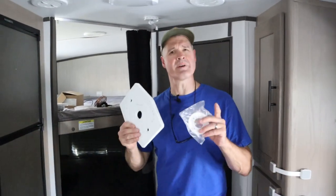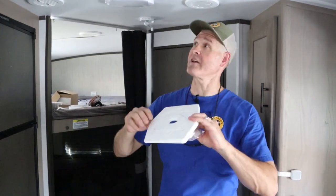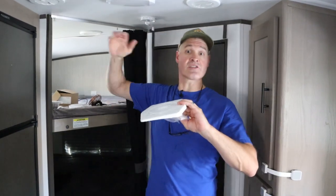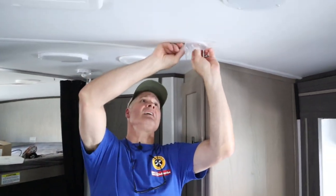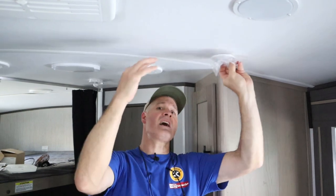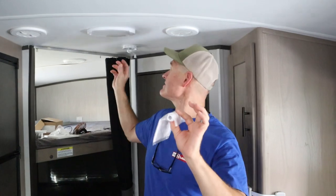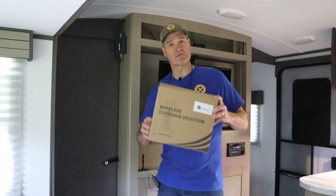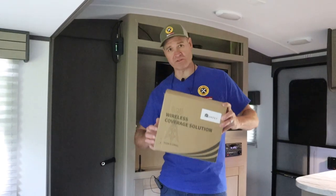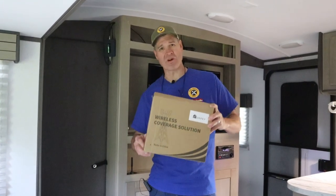After a small heat break, it's the next morning. I want to talk a little bit about some of the accessories available for the WineGuard antenna. There's a slanted roof wedge available if you mount yours on a sloped roof, and there's another wedge available for the inside that levels out the crank if you mount it somewhere other than the center. There's also an extension available in case your roof is thicker than four and three-quarters inches. I'm working on a video to test the performance of this cell phone booster system, and when I'm finished I'll put a link to it right here. I'm glad you watched and I hope you watch again.